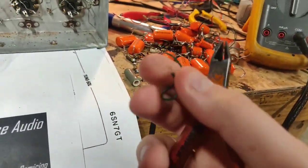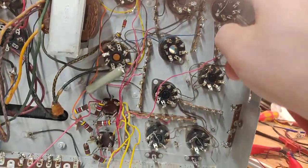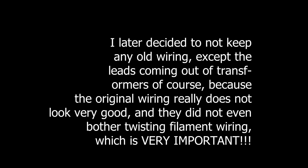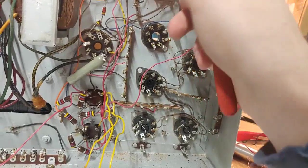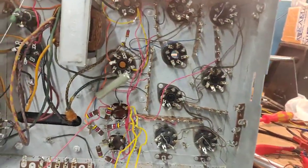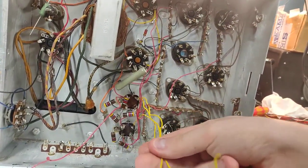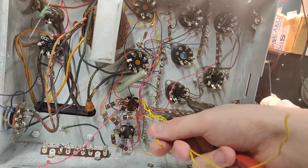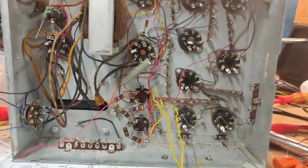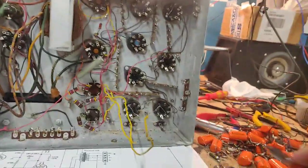It's just a matter of looking through everything and finding what is going to stay and what is going to go. Most of this wiring is that kind of rubber that gets sticky, so a lot of it needs to be replaced. The heater wiring I'm going to just keep — there is nothing particularly wrong with it. These yellow leads are all cathode bypass caps, so we're going to reuse a bunch of those. These are high tension off the resistors and stuff, going out to different places which can be used as plate supplies.